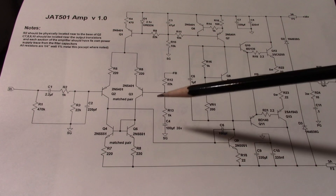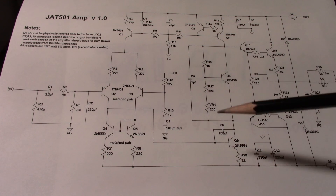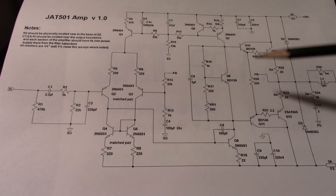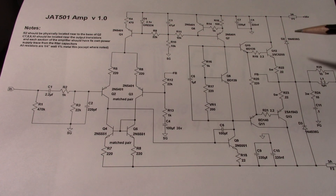From that point on the amplifier will have changes. There'll be some changes in the voltage amplification stage, and the main difference will be the output stage where there'll be paralleled output transistors. Because of the safe operating area of the transistors we have to watch out for, it would be good to parallel them when delivering such high power.